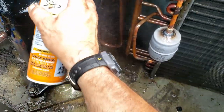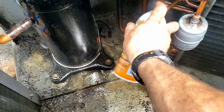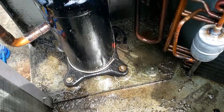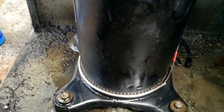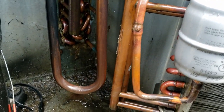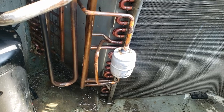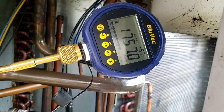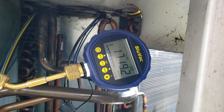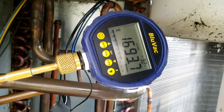The degreaser may not be worth a crap — it smells pretty but I'm not sure it's all that great. In a best case scenario maybe some of the rain will wash some of it away, but it's not going to be perfect. Actually, this stuff really wiped off pretty good — you can see the feet, what they used to look like. It wiped all that POE off of it. Definitely lost some oil, but I don't think it's enough to add any — though there's no real good way to know how much was actually lost. Always love it when the vacuum goes negative after you valve it off.